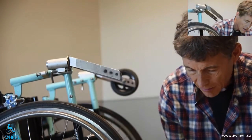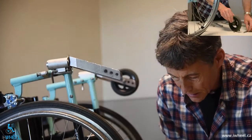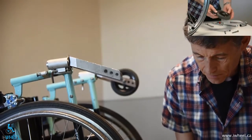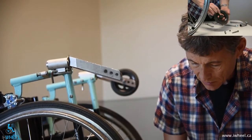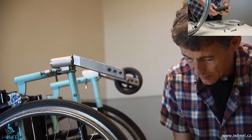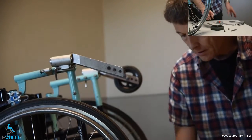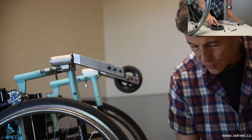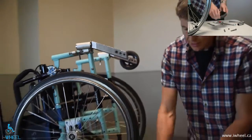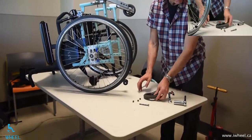So this is what I have: a wheel, a spacer, a spacer, a bolt that goes through, and another that secures it. Here are my bearings — one on each side, and they spin freely. To reduce wear, pull all the hair out — all the hair from here — and make sure it's as clean as it can be.